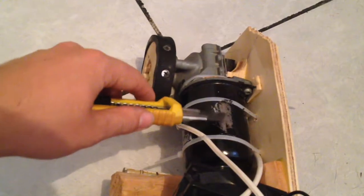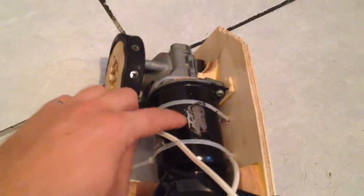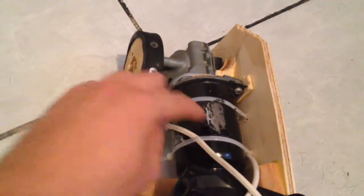So I took the motor off the cart. I have it here with the motor arm and I'm taking this box cutter and scraping the paint off. I want to make a heat sink — I'm going to have heat fins here to dissipate the heat so it doesn't overheat as much. I'm going to try this metallic tape, like a tin foil tape, and make little wings out of it. It's the easiest so I don't have to solder any connections. In order to get the heat from the motor easily into the tape, I want to make sure there's no paint or anything else, so I'm scratching it all the way down to the metal.